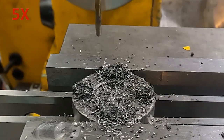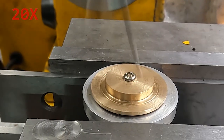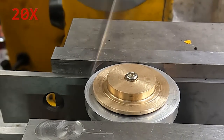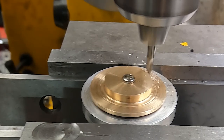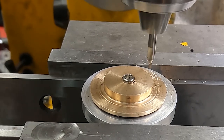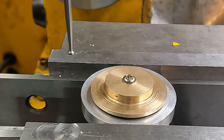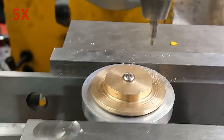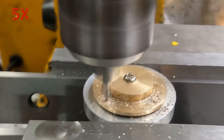This is giving pretty good footage. I also figured out why I can't do 4K video in my editing software — the trick is to not use the HEVC compression in the GoPro and to use preview files. This is where the mounting stuff starts to go wrong. I have it mounted on a piece of aluminum by a single screw through the middle, and it turns out that single screw isn't up to keeping things tight. I immediately notice on the first hole before it even goes through that it has loosened off. So I take it out, put in a lock nut, tighten it all up again, remount it, re-center, and go for it again. The vibration here is mostly the camera moving, not the machine itself.